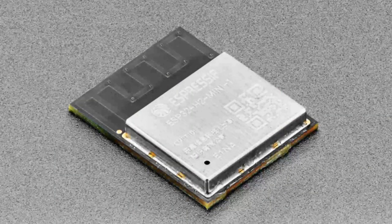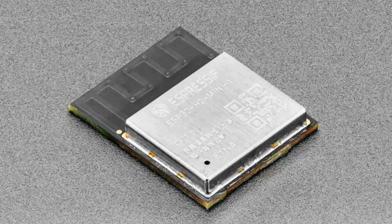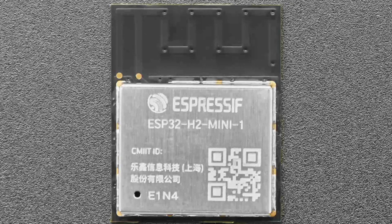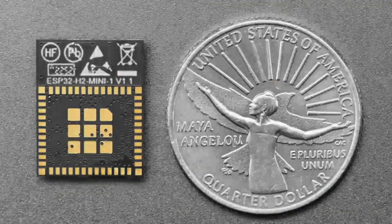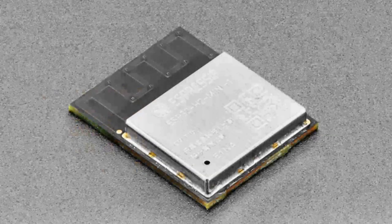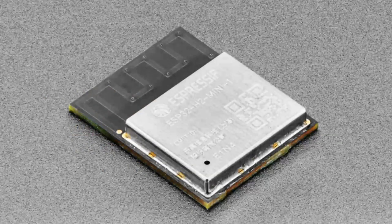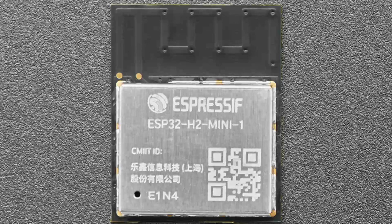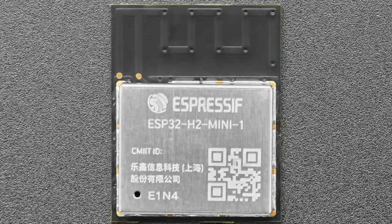We've got two upcoming devices from Espressif. This is the ESP32-H2 series. These chips are developer use only right now. They're still going through certification. These chips are not Wi-Fi. They have Bluetooth and 2.4 gigahertz radio, so 802.15.4, you know, sometimes used for Zigbee or point-to-point or mesh communication. So not Wi-Fi, but probably going to be a lot lower power and really good if you just want to do Bluetooth. So they're kind of trying out new chipset options.